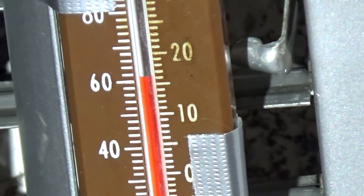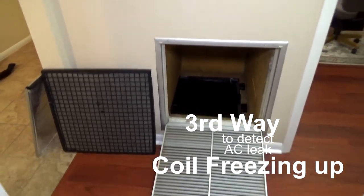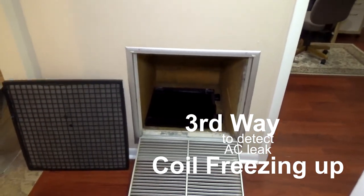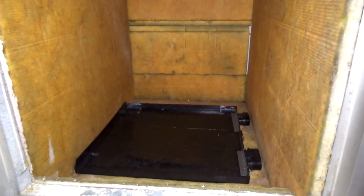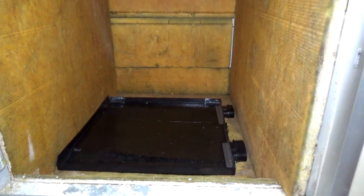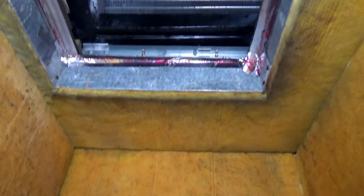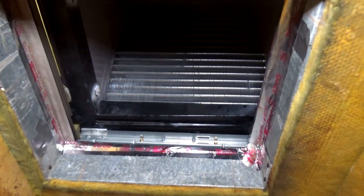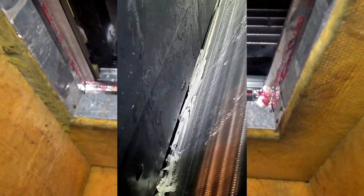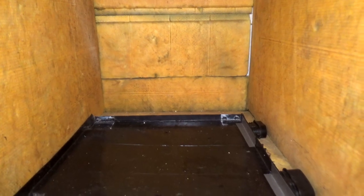Number three: this happened to me twice with my old system. This is where my AC is located and the area flooded twice. After putting in the new unit I placed an old pan to collect water. Here's what happens — when your AC is low on freon pressure, the coils start freezing up. When you turn it off, the ice starts dripping and this whole area was wet to the point where it flooded my entire hallway.